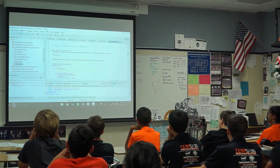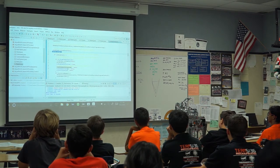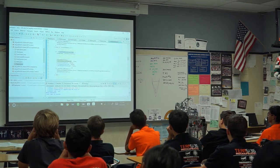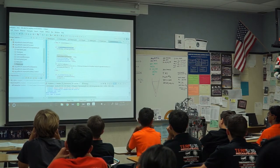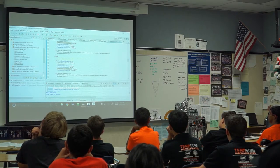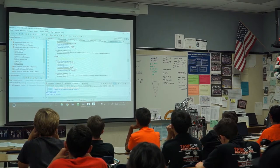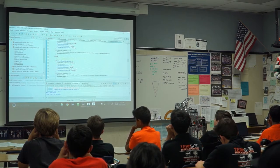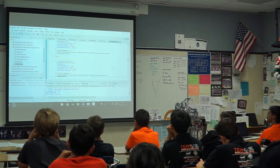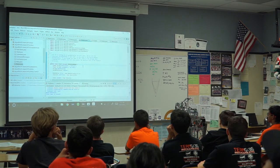It goes on forever. See that? So that actually is where all of your teleop and autonomous things are. That's where they live. You just have this view of them. But really, this is the code that's happening, and it's calling the stuff that you had. Where is it actually? Teleop periodic. There we go. And this actually happens 50 times a second, and you want that to keep happening 50 times a second.